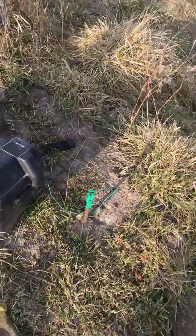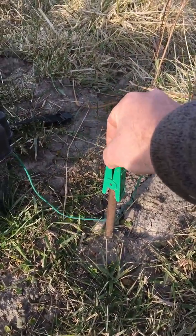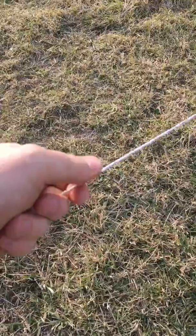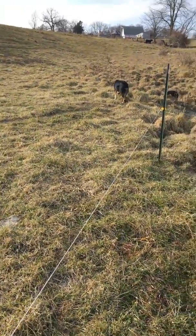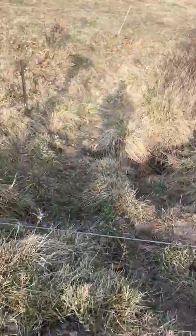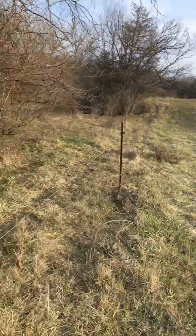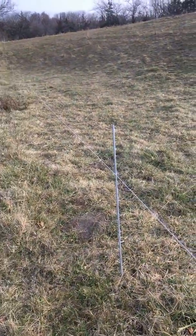Here's my ground — I got a ground throughout the whole farm. It's just a copper lightning rod that I pounded in; she goes into there. This is where the actual poly wire hooks up. I had to run this because the high tensile fence I put down wasn't electrified at one point, and the deer plowed through it and a couple of my calves started going underneath it — it wasn't giving them any shocks.